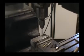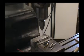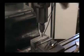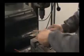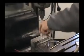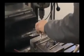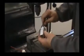After that I'll flip it on its side and drill and tap for a set screw. I'll use the set screw to hold the piece into the fixture, and I'll be able to turn the piece any way I want because the hole is in the middle. I know if I pick up the sides of the fixture exactly where my center line of the cutter will be. After this we'll deburr it with the reamer and check it with a quarter inch dowel for a nice fit.